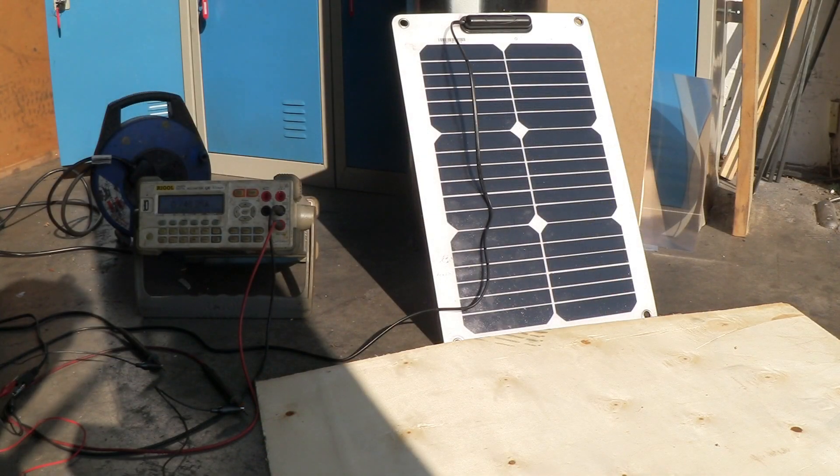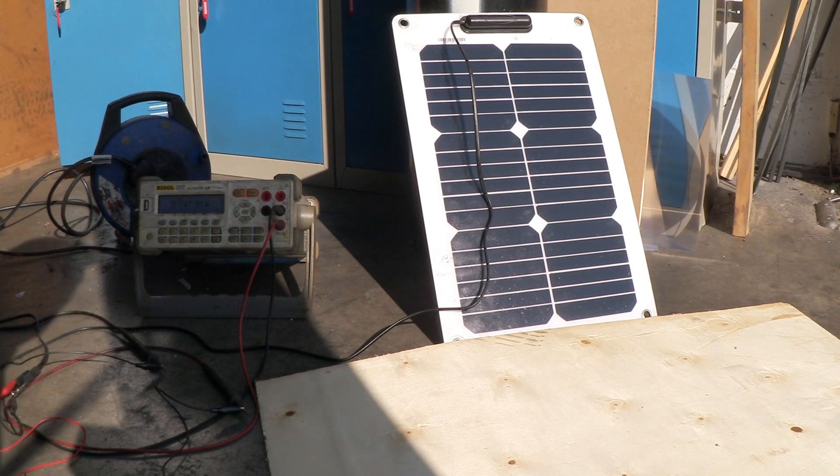All I've got here is a little solar panel over on the right that I bought from Maplin when it was still trading, and we've attached the meter to it. It's reading amps — at the moment 0.746 amps — and the load on it is a coil, a heating coil from a kiln actually. The volts is about 20 volts. It actually gets quite warm. You'll notice this mysterious bit of timber at the bottom — I've covered something up and I'm about to pull it off so you can see the difference.